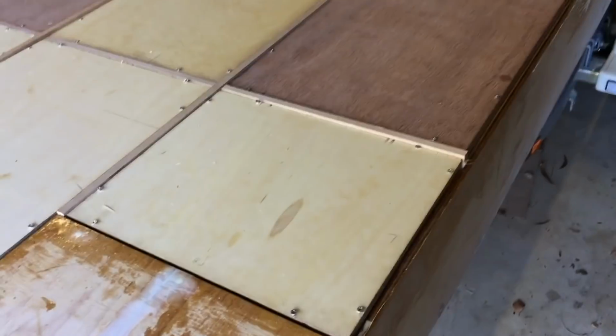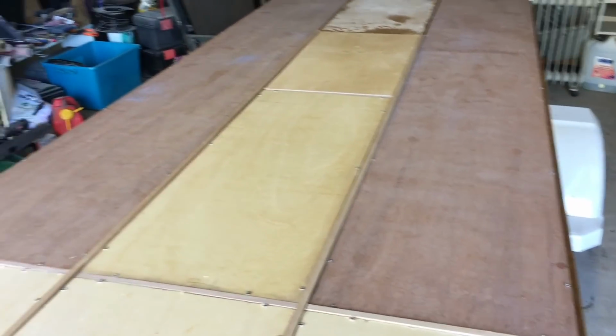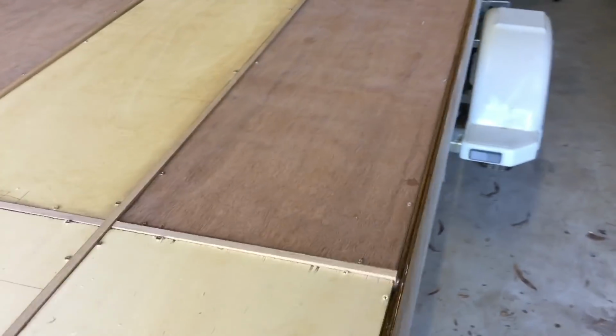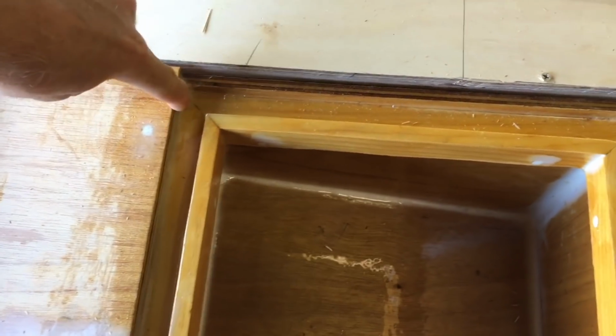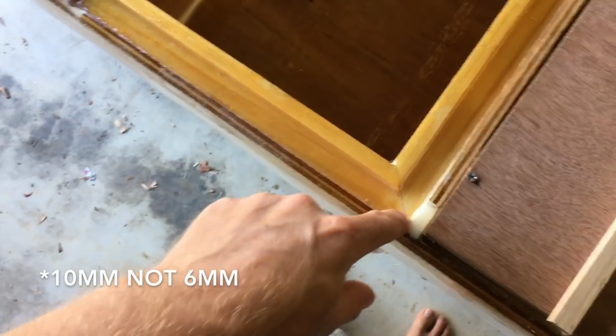I'll show you what we got up to yesterday. So with Hamish yesterday, we got all the hatches cut out. We had to use 2 sheets because it wouldn't all cut out with 1 sheet, so that's why they're 2 different colours. But it's all marine ply. All we did is measured from the outermost part there all the way to the outermost part there on all 4. And then you take 6 mil, so you give yourself 3 mil play because we've got rubber going in.